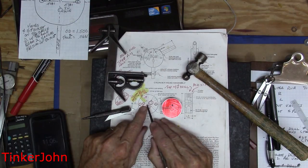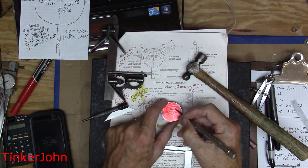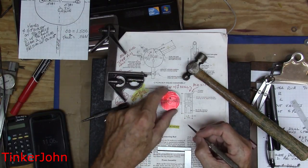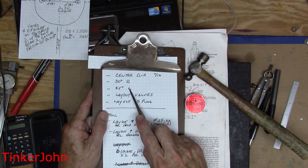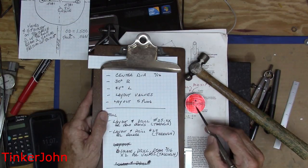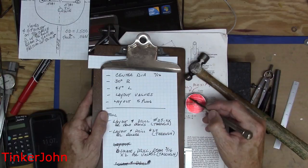Go ahead and get that punched. That one looks good. I just did that backwards, so I marked it out — that doesn't hurt anything. That's the purpose of making little light pip marks. I've got to come down and move that hole down here. Then just make that one. So now I've got these three holes marked: 30, 45, and 90 degrees. That's all I'm going to be doing on the first part — I've got my center, 30 degrees to the right, 45 degrees to the left, marked my lines. I've laid out my two valves and laid out for my spark plug. These two valve holes will go all the way through — they'll be 3/16ths. This spark plug hole is only going to go partially through to pick up where the spark plug comes in. That's the layout. The next step is we're going to go to the milling machine and start doing some drilling operations and go in from the side to do some of those layouts also.